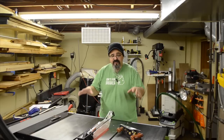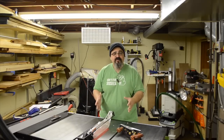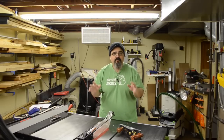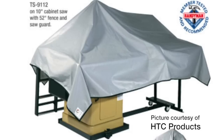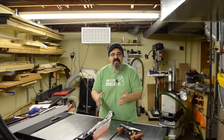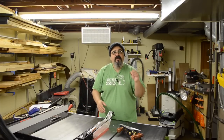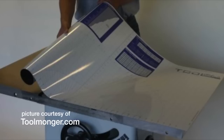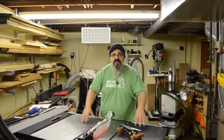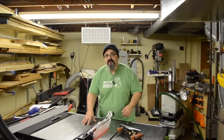Another important aspect of winter woodworking is keeping our tools from rusting, because there's nothing worse than a really rusted and pitted surface on your table saw, jointer, or bandsaw. Taking care of this is completely about being preventative — cover up your tools. You can use tool covers, many of which have a rust-inhibiting factor, or something as simple as canvas to impede moisture getting onto the surface. Magnetic covers that sit directly on the metal are a worthwhile investment.